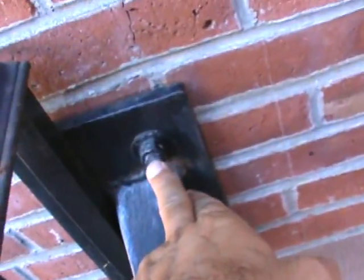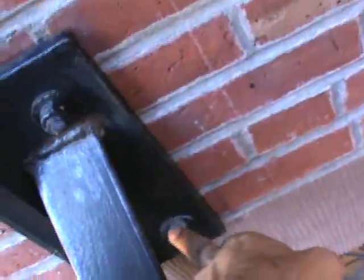Half inch expansion, as you can see, just comes right out of the building. So those are really just grabbing onto the brick veneer. That's incorrect. Now I'm going to end on this platform and then start another video clip that includes the cantilever down below. This is an expansion bolt. Look, this is a half-inch expansion bolt.